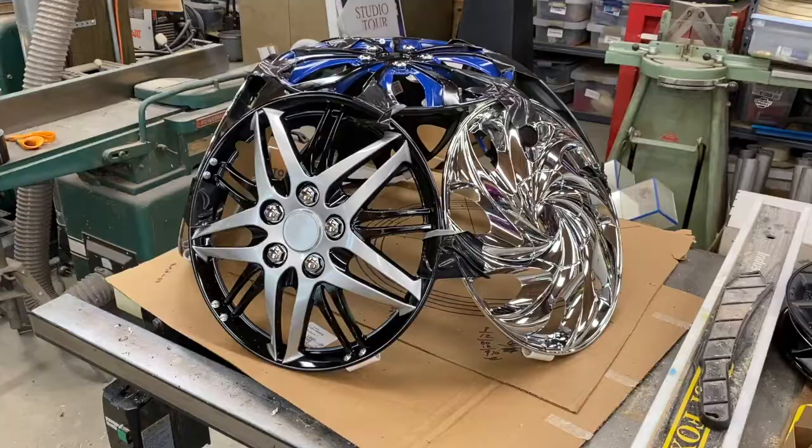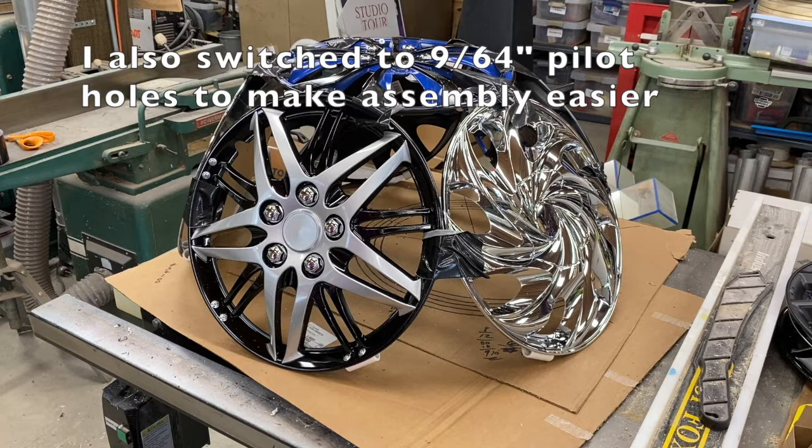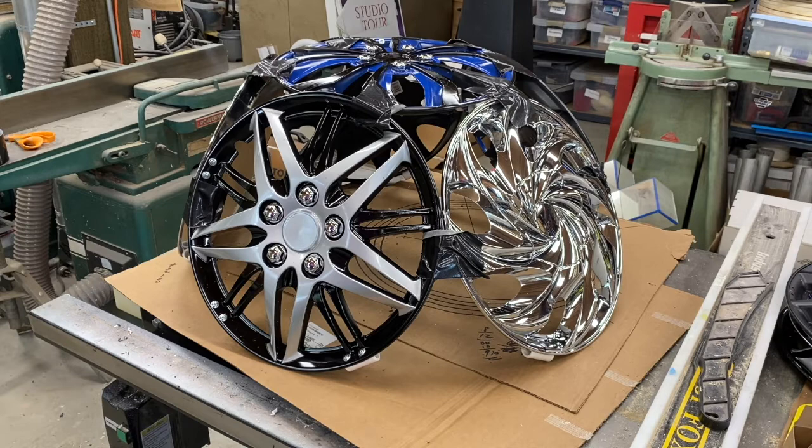Now, one of the things I did differently for the 12 hubcap construction is that once I had the first six hubcaps drilled and ready, I taped them together, whereas it's easy to estimate 90 degrees, it certainly isn't easy to estimate the correct angle for making the dodecahedron. So by taping it together, you naturally find that angle.